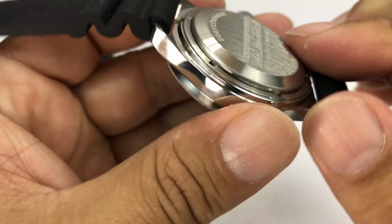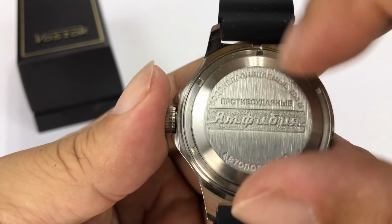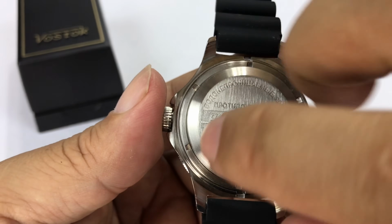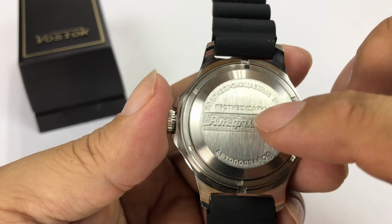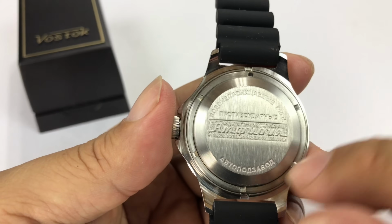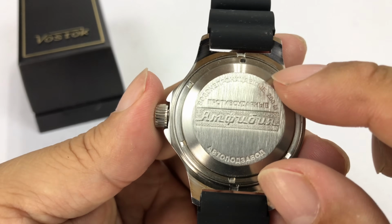Now, water can get into a watch in the back too, and this is where they were really innovative. What I talked about here is that most watch backs, the case backs, you screw them on, there's an O-ring, and so what you're doing is you're compressing the O-ring and you're shearing the O-ring. So you're pressing down on it, but then you're also twisting that O-ring as you're screwing on the back. And because they couldn't, I guess, machine the metal to be super tight and then have really accurate, precise O-rings too, what they did is they created a two-piece back to solve the problem.